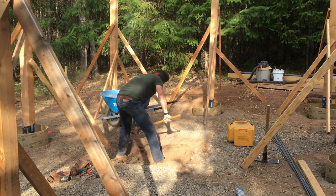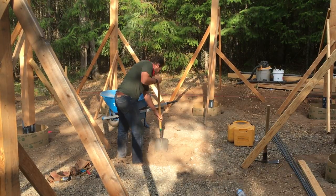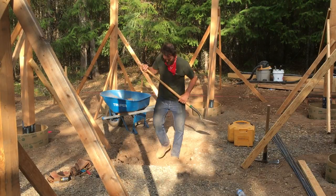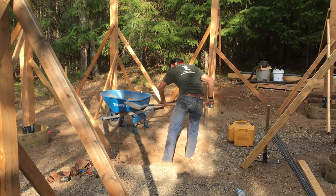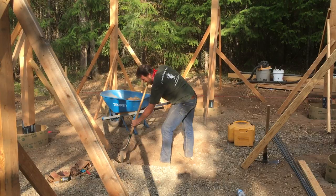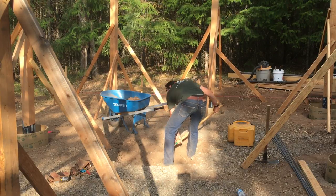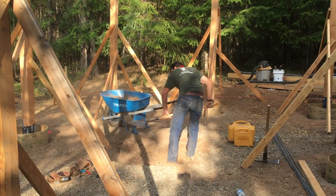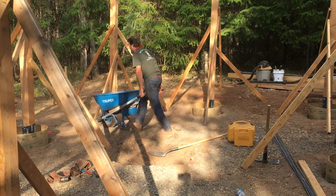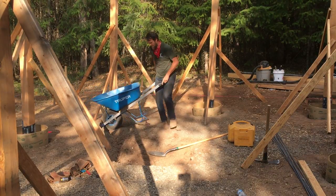After a few visits to the engineer's office, I realized that two things had occurred. We needed to make a slightly more beefy center foundation for the middle post that was added, and also the floor system was a little bit low at this point, so in order to get the thickness out of our concrete, I had to dig down a little bit more. Obviously this was an afterthought, otherwise I would have done this with the auger earlier when I dug all the other holes. But you know, hindsight is 20/20, as they say, and I probably needed the workout.